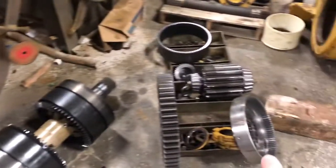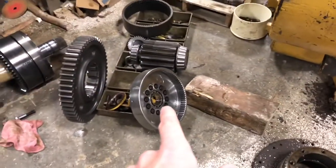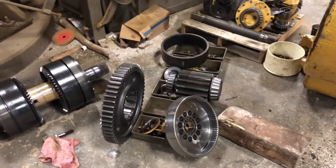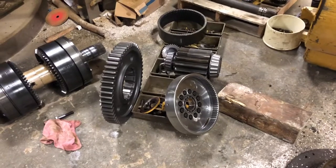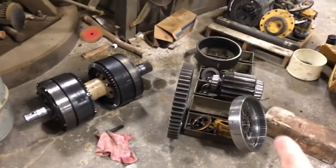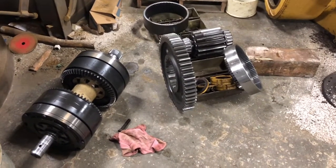There is huge holding power on the brake — there are seven frictions in each clutch, so 14 frictions are holding your drum. But when you go to line in, there's only four frictions in the input clutch, so the input clutch is the weak link in most Cat winches. If you have trouble with a Cat winch, our first place to look is the input clutch, just because there's fewer frictions for how much horsepower goes through it. If you're feathering and doing inching work with a PTO winch, that's what cooks that input clutch.